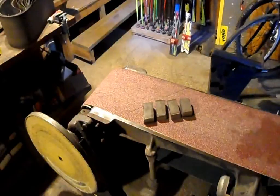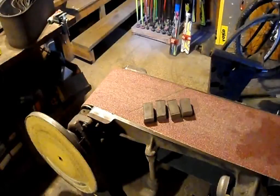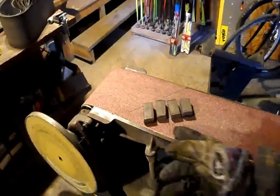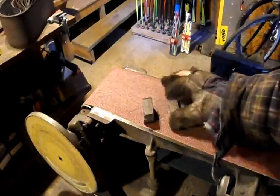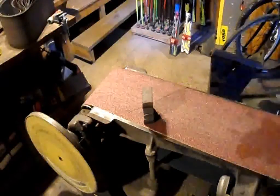Once your bar has been cut into pieces — my bar, for instance, was 8 inches long — so I cut it into 4 pieces each 2 inches long and polished the faces of them. These pieces, each with 9 layers in them, will stack together to make 36 layers of Damascus in this next billet.